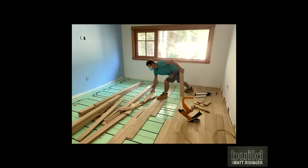When you see this in person it makes a lot of sense. The hardwood installer can see the red PEX tube clearly, and it's not hard to avoid. As a side note, in this job he's both gluing and nailing — you can see some PL Premium glue being applied in a stripe. It's an aluminum facer on top of the WarmBoard, and that PL Premium works awesome. Then he's dropping nails in there as well, and when he's popping nails on that pneumatic nail gun, it's a no-brainer to miss the tubes.